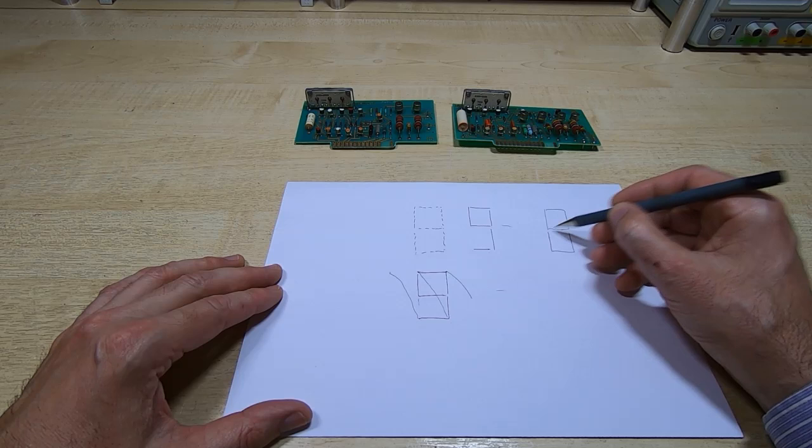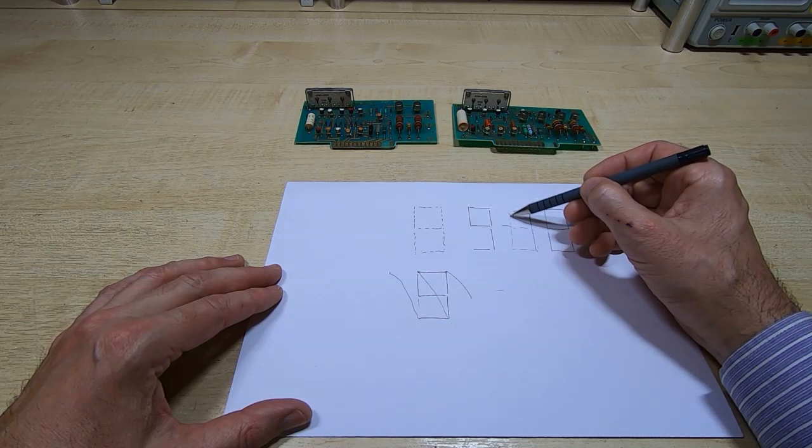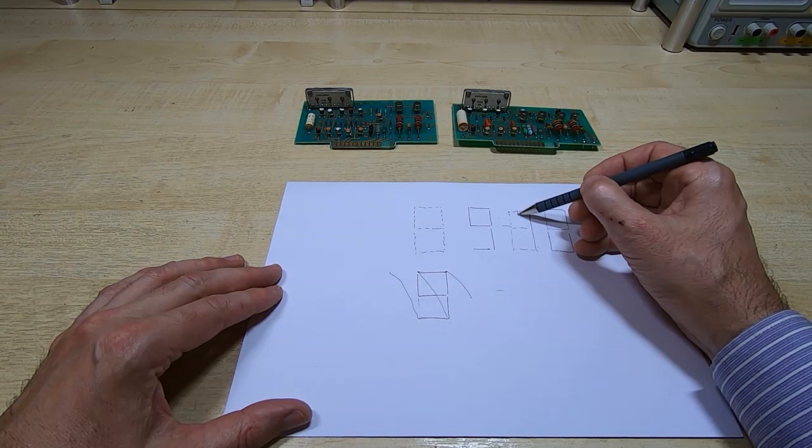If this is where this character would normally sit, if we just use either this section for the 1 or this section, you can see that you get a small gap and a big gap, or a big gap and a small gap. So instead, it has the ability to move a half segment width, and then it can draw the 1, and that puts the 1 in the center of the space.